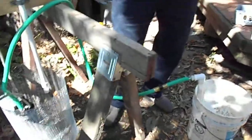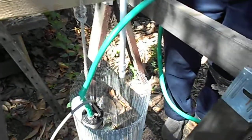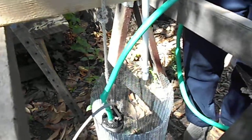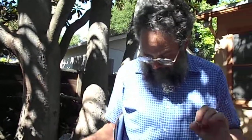Vertically, 200 feet is the most per pump. If you pump 1,000 feet horizontally, you lose some of that vertical head — you can probably only pump 150 feet straight up. That's one of the critical pieces of information, because you need to know how much pipe to buy and how far apart to put your pumps. The key questions are: what is the vertical rise, and how far apart are the pumps going to be? All of that is in the papers we'll be sending.